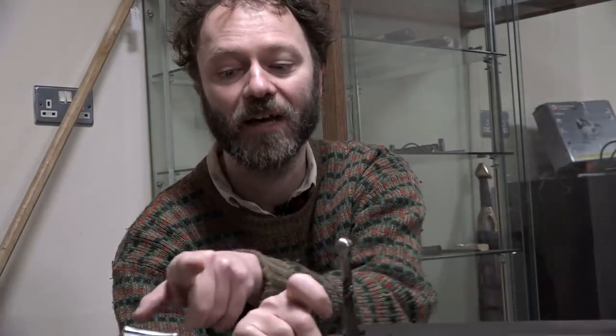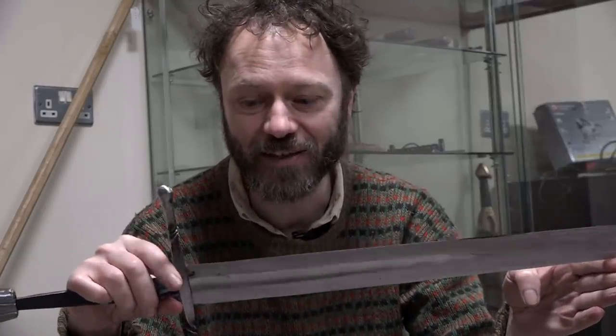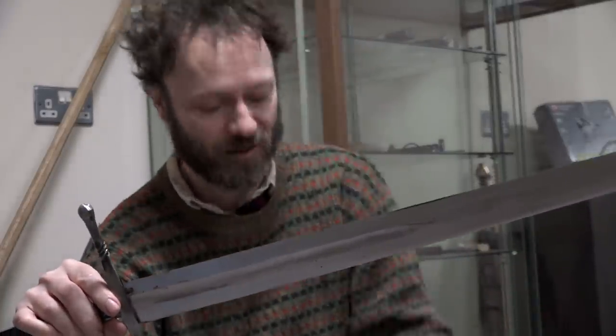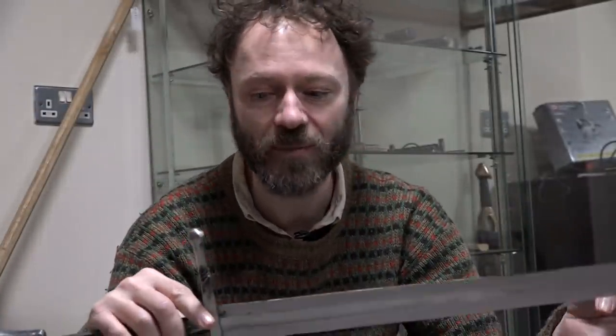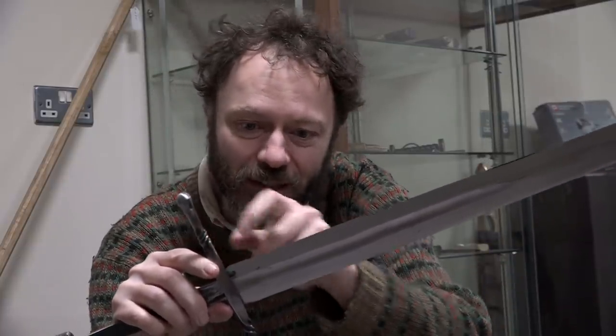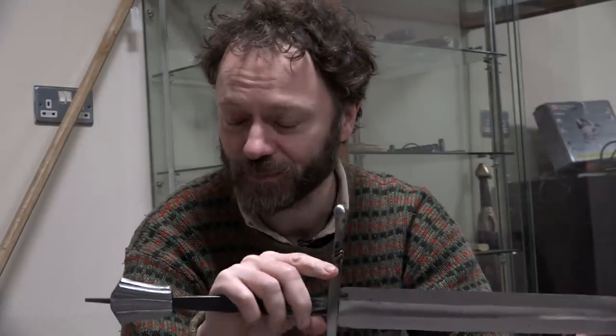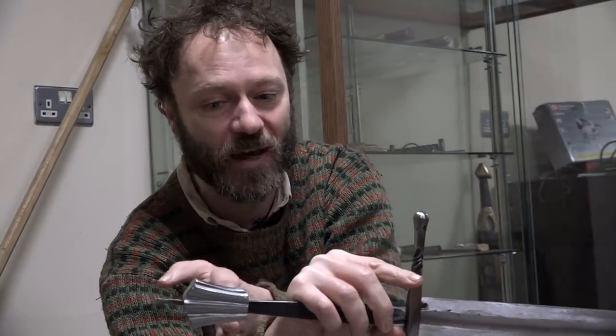So you can see, the wooden grip still needs to be made, and the next stage is sandpapering. I've got various different grades of grit here, and I'll be going from coarse to fine, trying to get out the black soot that's worked into all these little niches here. We've got a shaped pommel now, and we're reasonably happy with how far up the tang that goes. The very end of that will probably be taken off, then that'll be heated and hammered, and that'll hold everything together.